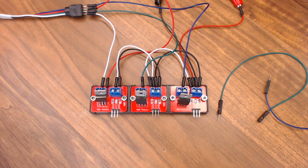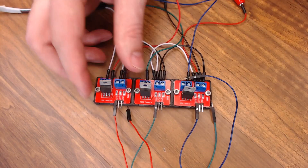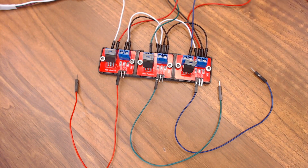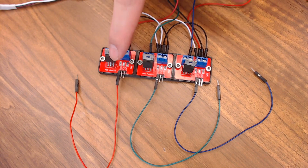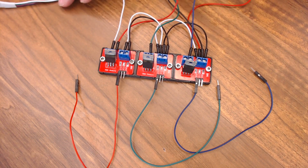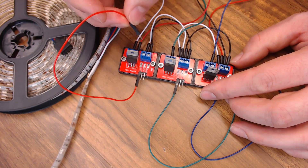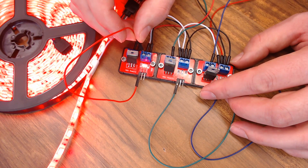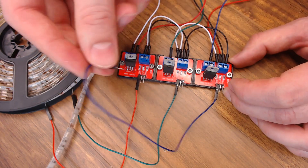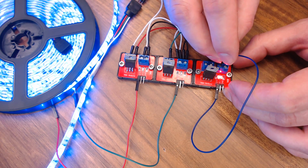Just for a test, let's cable a jumper up to the signal line on each MOSFET — red, green, blue. Make sure your leads aren't touching anything currently; we don't want to short anything out. Let's turn on the 12V power supply. When the main board turns the signal pin high, that will turn the MOSFET on and let the 12V current flow to your LED strip. To simulate that pin going high, we'll take the signal wire for the red LED MOSFET and make it go high at 12V. We're red. Same for green — make it go high. Now we're green. Final test, make this one go high. Now we're blue. So we know all three sections of our LED are working and our MOSFETs are set up correctly.